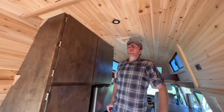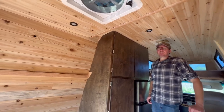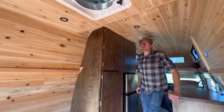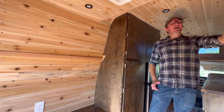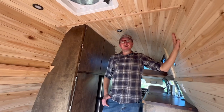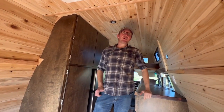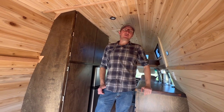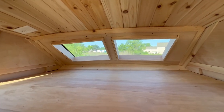Tell us a little bit about the woodwork in here. The woodwork is cedar, slightly aromatic, so it kind of freshens up the van both visually and smell, obviously. One of the challenges of the van is that it has a fiberglass shell, so there was no existing structure to mount the paneling to. So we had to go inside the van and we built a free supporting dome out of 2x2s to hold the ceiling up. So up front, we just framed around the existing windows.